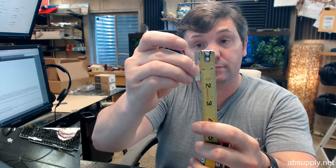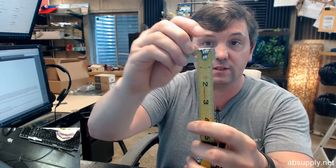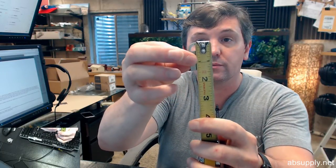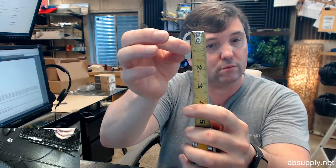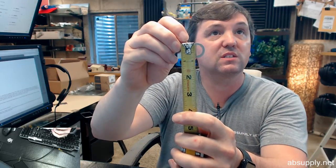Okay, let me give you some dimensions of the 2 strikes. The mortise strike, about 1 inch and 9/16 by 5/8, and they're very thin. Realistically, you wouldn't try to mortise that. That's so thin you'd probably just surface mount it. Then your rim strike, or your surface strike, about 1 inch and 3/8. The width, about 13/16 as well. Okay, nice quality item from Richelieu.